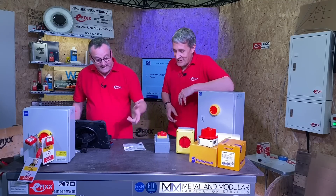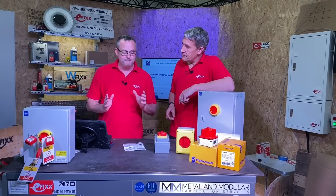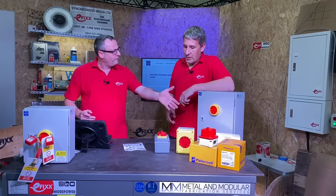I've got the instructions in front of me here, so if I just pop it up here, you can see it on the screen now. Let's look at the symbols underneath two-pole, three-pole and four-pole switch. That's the symbol for an on-load isolator — that's what we're looking for, and we'll explore it a little bit further in BS7671 in a minute. Can you find it on any of these?